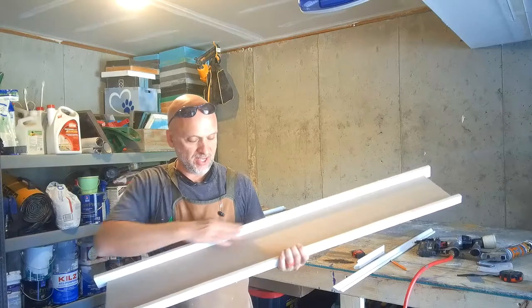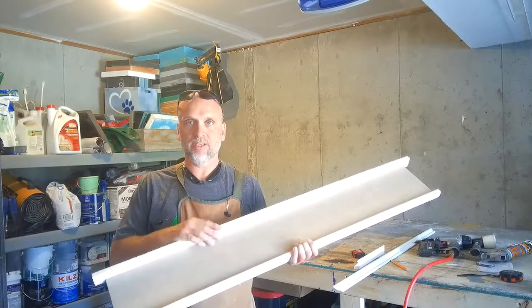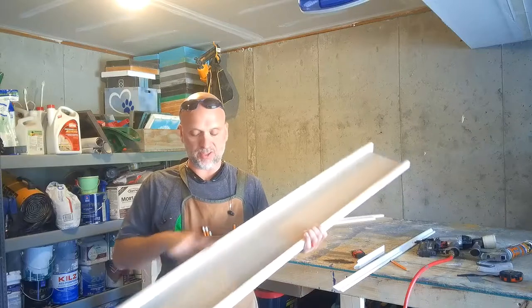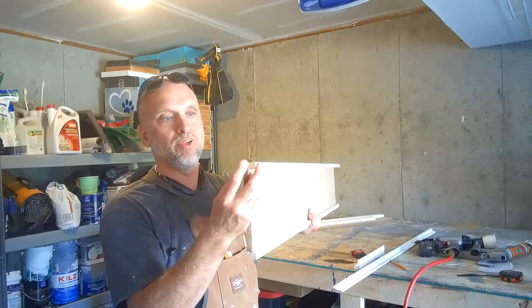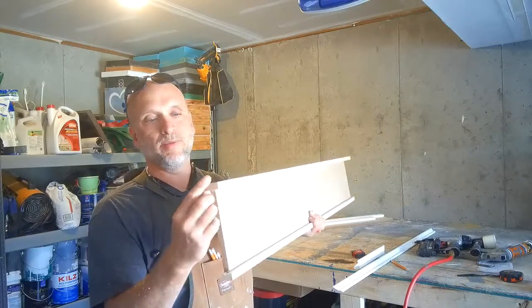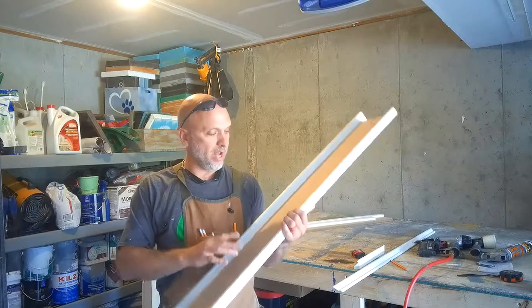It really needs to be sanded — I need a new blade on the table saw, so it's kind of rough. You could use MDF to do this, but MDF is really gritty and I really don't feel like putting all that primer on it, so I'll just sand this really well. The only drawback to the shiplap is that it has a small groove, but you could cut a short return and not worry about that. I just put a little wood filler in it and it paints right out — nobody will ever see it.